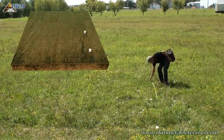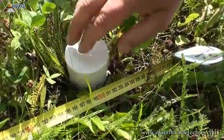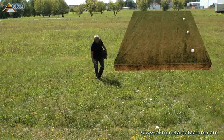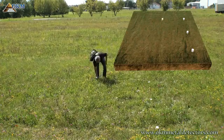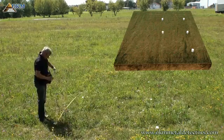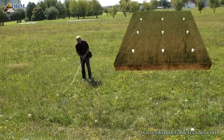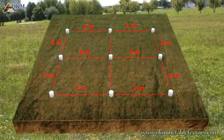We repeat the same procedure for the third scan point marker, so now you reach the final field length of 4 meters, which is what we have entered into the new scan dialog before. In the same way, you have to place all other scan point markers for the rest of the scan area. Now all of the scan point markers have a distance of 2 meters to their direct neighbors.